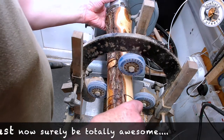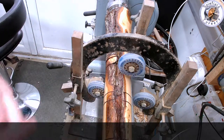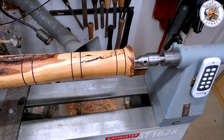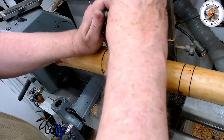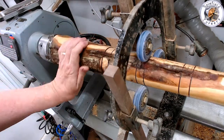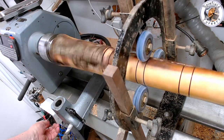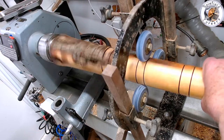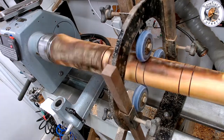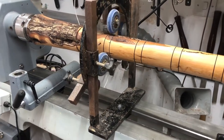I'll mark where jaws one and two are, center it at that end, then do a few trial adjustments to get those wheels just touching without them digging into the grooves in the wood — a bit of slackening off one and tightening up the other so the rig doesn't bounce around. I'm glad I've got one of these because I just don't think it would have been safe to drill such a long piece all the way from one end.